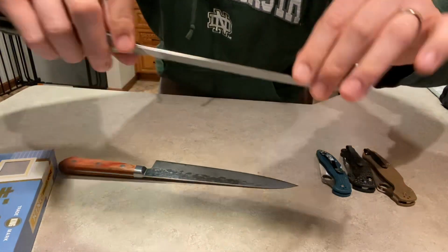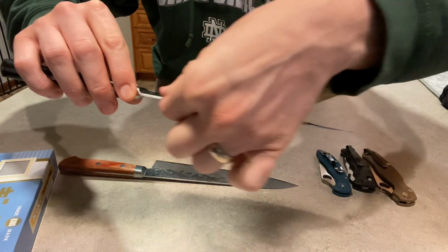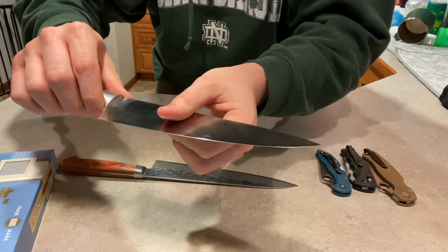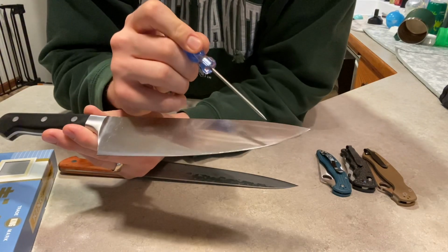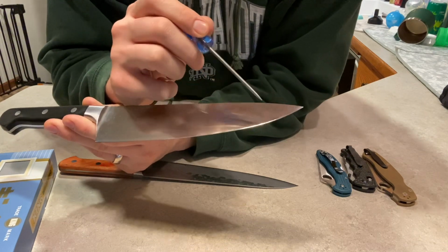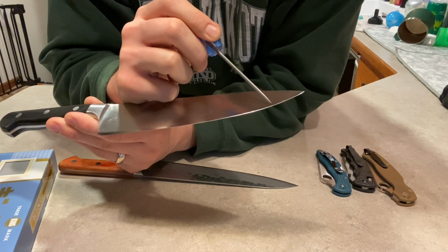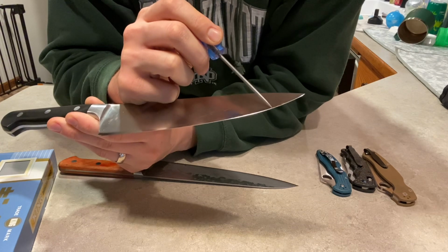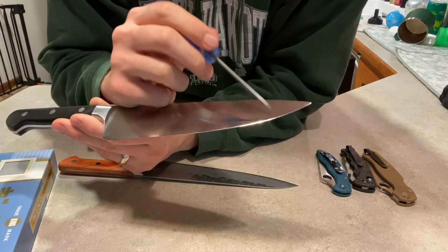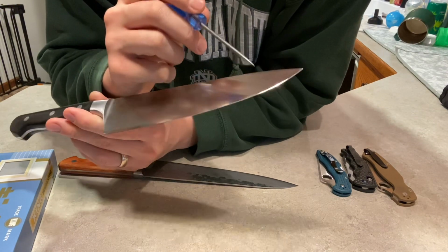And this is why. Almost all knives, especially kitchen knives, are going to be doubly distal tapered, meaning from spine to tip, it's going to get thinner, and from spine to edge, it's going to get thinner. And so what happens is if you try to bring this edge up to the spine of the knife to keep that higher tip, you have a very thin cross section behind the edge right here, and that's super important for an easy, high quality cut. But as you go up this blade, it gets thicker just because the spine's thicker than the edge.